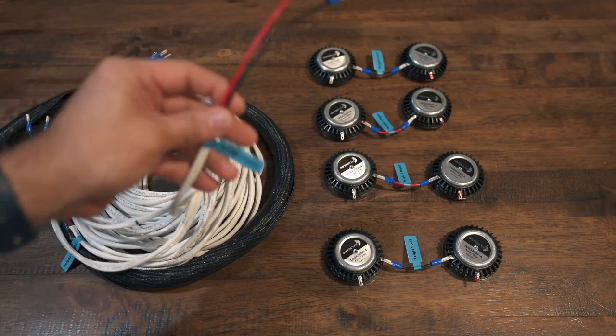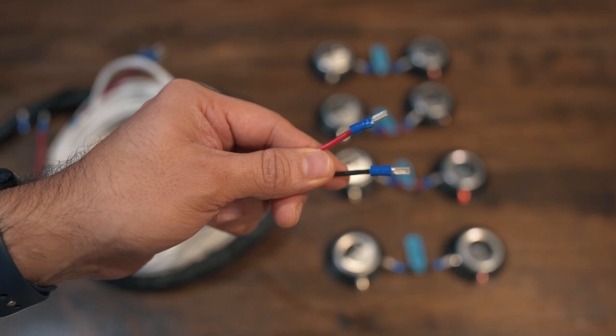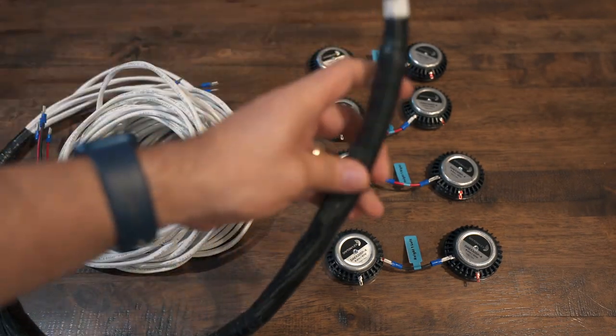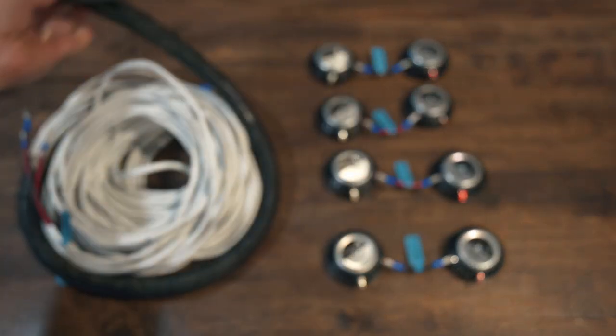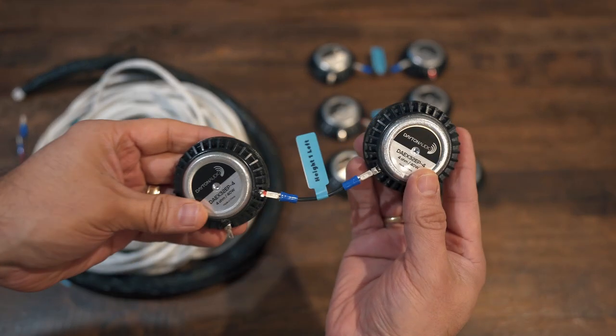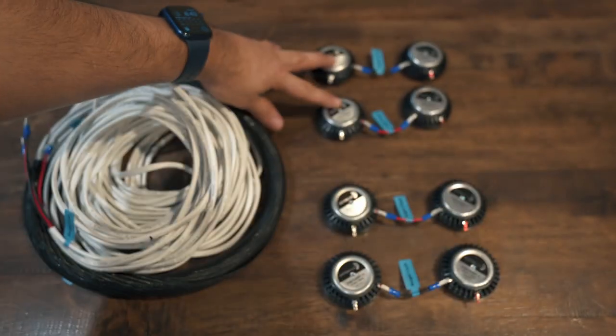With the plan set, I prepped the speaker cable and audio exciters. I labeled the speaker wire cable at both ends, crimped the terminals, wrapped the end with wire sleeve and electrical tape to keep it together and make it easier to pull through the wall. For each exciter channel I wired them in series so they'd become 8-ohm 80-watt speakers. Here are the front height set and rear height set.